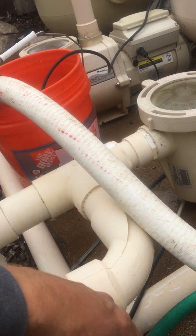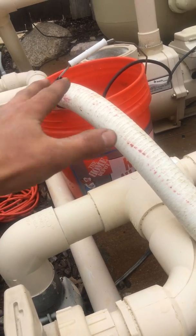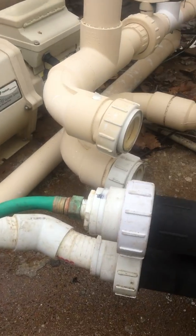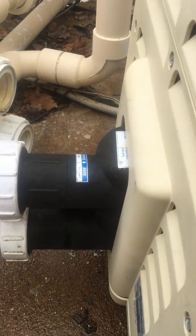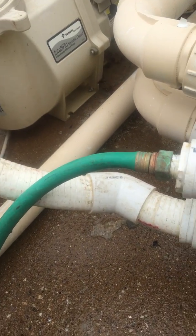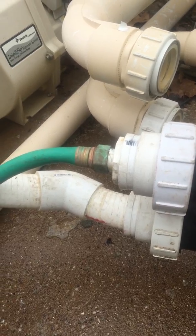I hook up the coupling and I do a mix of right around three or four to one — parts water to one part acid. So I put three to four gallons of water in there, dump in a gallon of acid, and then I just pump it through. It's going in this way, and then I use another MasterTemp coupling and just some flex pipe and I just circulate it.